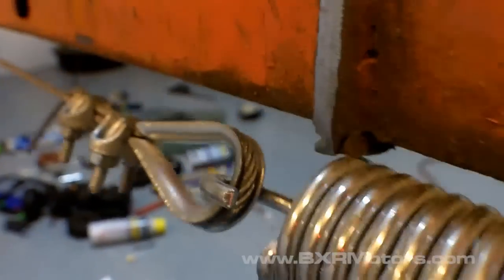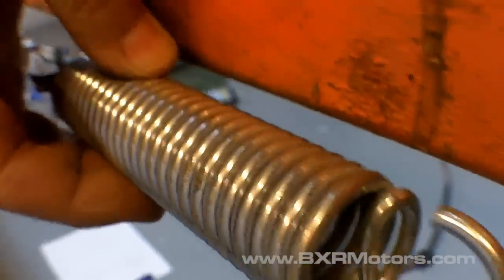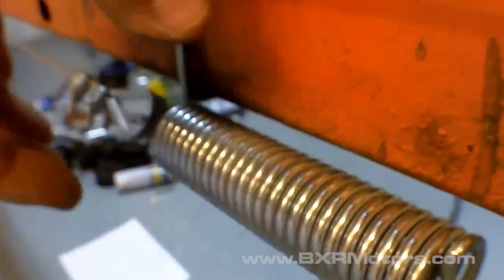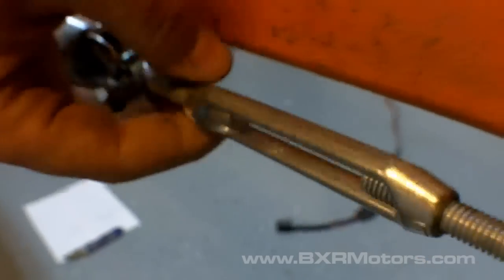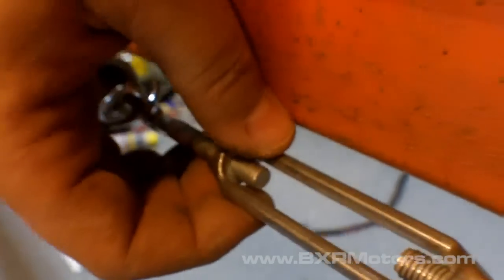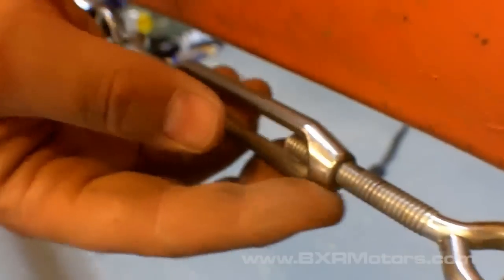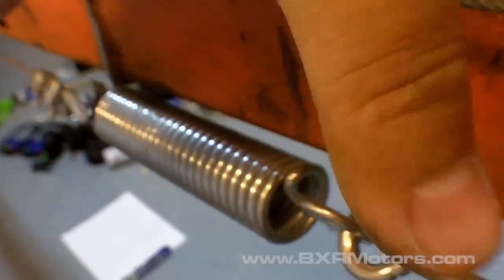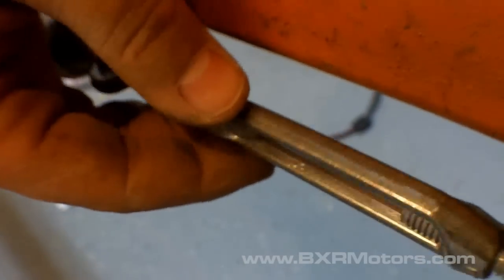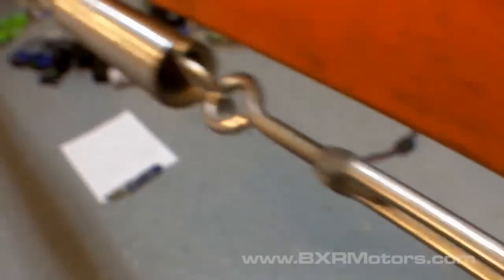Coming down the rail, you can see how it's connected. I have a huge 150- to 200-pound spring, which is applying tension on the cable. Then I have a turnbuckle set up next in line. The turnbuckle lets me apply tension to the whole cable system — I just turn it and the screw closes inward, pulling the spring more. It's a way of applying tension to cables. You'll see them on telephone poles, securing building pieces, and things like that.